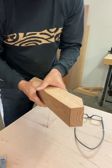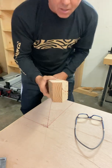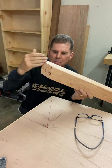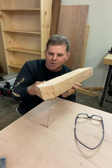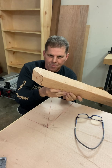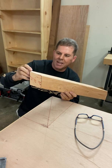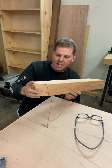So now the next question is backing angles. Everyone wants to back — they've done all this hard work and they want to put a bevel on it, especially if you have a fatter framing member. Some people back narrow framing members, but everyone pretty much with a bastard hip — excluding me, because I want to run up and down it — will back them. And I don't want there to be a point.